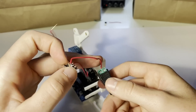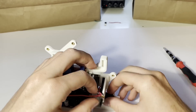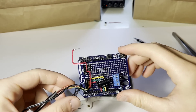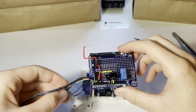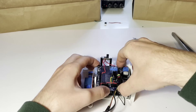Now I need to wire everything together. I'm using a master switch to control power from the wall going into both the UNO and the buck converter. I already soldered together this handy prototyping board to make it easier to route the power and logic to the servos and the thermometer. It connects UNO pins 8, 9, and 10 to the servos and the thermometer, and already has a capacitor for the servos and a resistor for the thermometer. It just fits right on top of the UNO.